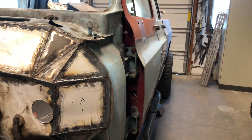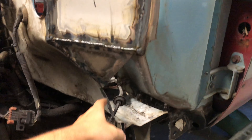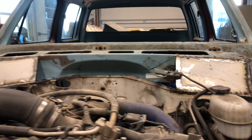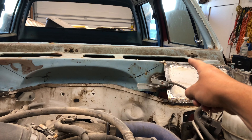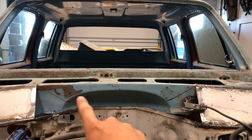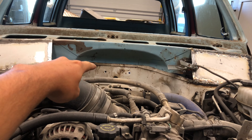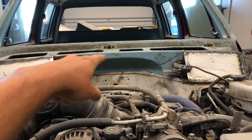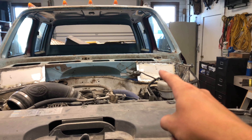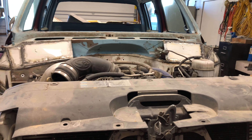I've put a few hours of work into this side and I've got a lot of it welded up. I'm going to do one more plate — just a triangle from here to here to here — and then it will be matched to what I've got on the other side. For the center, I'm going to run a plate from there down to there, a triangle, a skinny piece, and then a square piece in the middle. One thing you may not have realized: the trans-tunnel indentation is not centered on the Duramax, but it is centered on the square body. So it won't be perfectly symmetrical — that's just the way everything lined up.